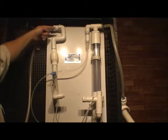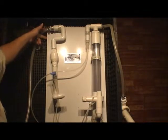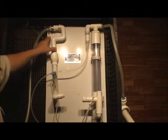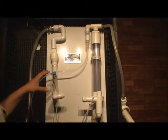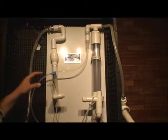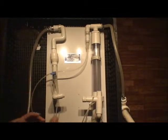You can use a pressure regulator to control pressure, and you can use a water flow rate meter to determine the water flow rate. The capacity of the Olas pump is that it will see as high as 12 gallons per minute flow rate, okay? In my opinion, the Olas Ti loses its efficiency when you move to a flow rate of below 24 ounces a minute on the inlet side. That's my personal experience on this system.